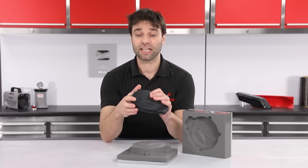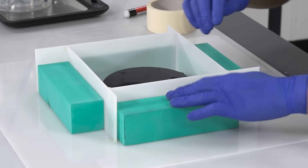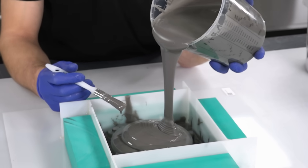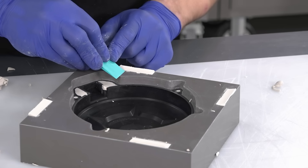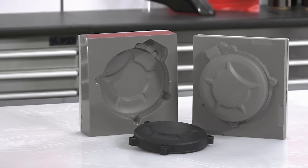In summary, the process involves adding an extension of plasticine around the perimeter of the part, creating barriers off that, then casting the A side of the tool. Once this is cured it can be flipped over, the barriers removed, some release features added, and then the B side can be cast, leaving you with your match tool.